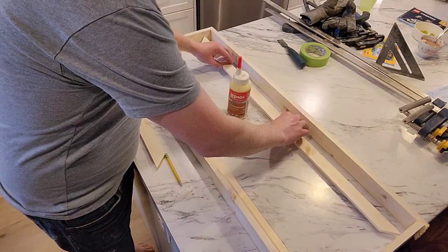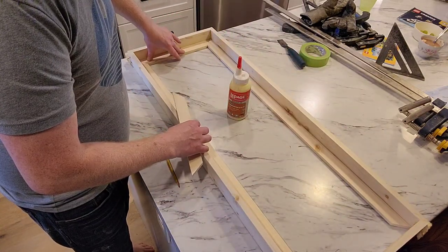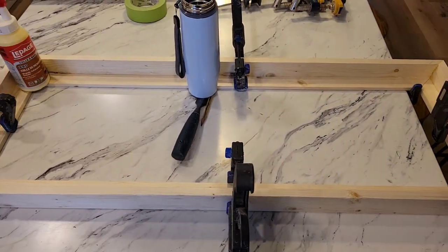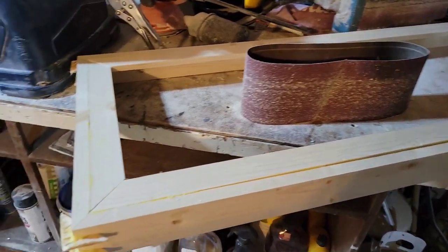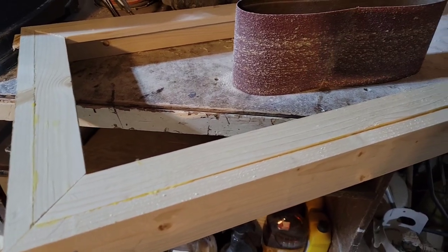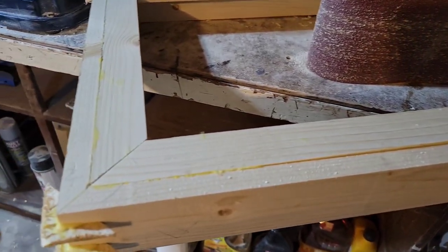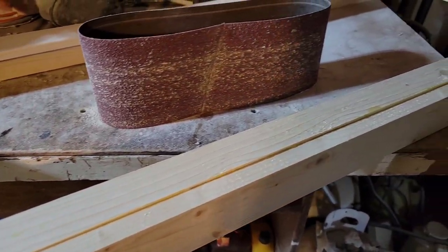Here I am starting to put in the backing. I've cut all the backings to a 45-degree miter again using the one and two method, glued it up, and basically used whatever I can to make it stick. When I put the frame together I forgot to make sure the bottom piece was clamped all the way down, so I've got to sand that flat. It won't matter in the final product but it sure matters what I've got to do now.